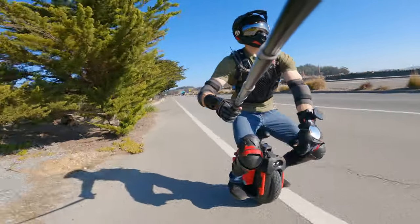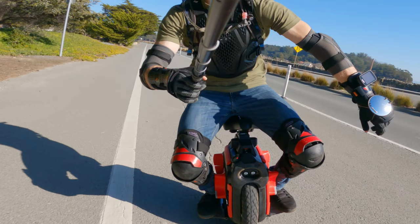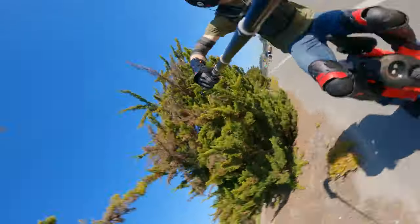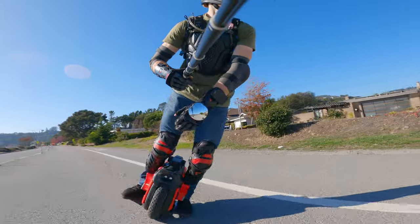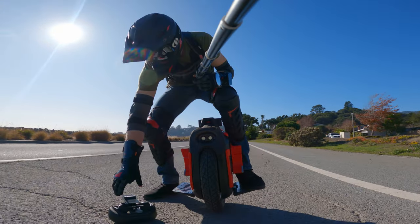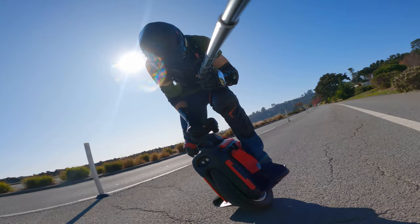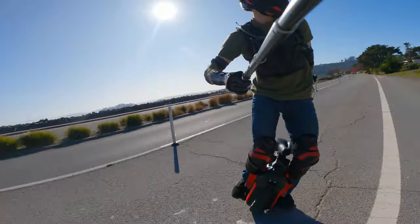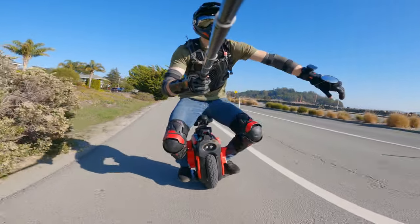To properly show the limitations of this prototype, let's watch this fail. You can see exactly how I messed up trying to carve the wheel before all of my weight was situated on the saddle, and the momentum plucked the saddle assembly out right from under me. This was primarily bad technique, but after this experience I improved the depth of the recessed part by 4mm in the final design to diminish the chance of this kind of fail. No harm, no foul — goes right back on. Luckily I wasn't next to traffic.